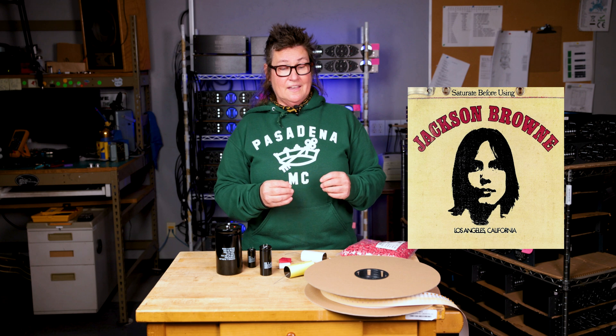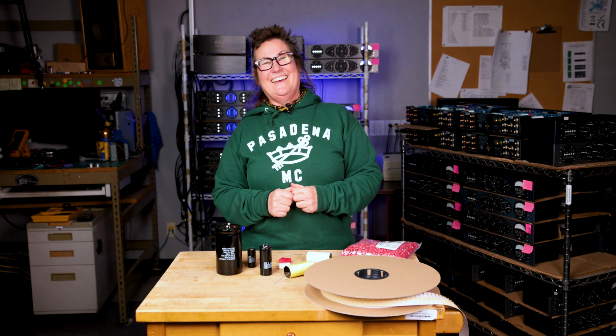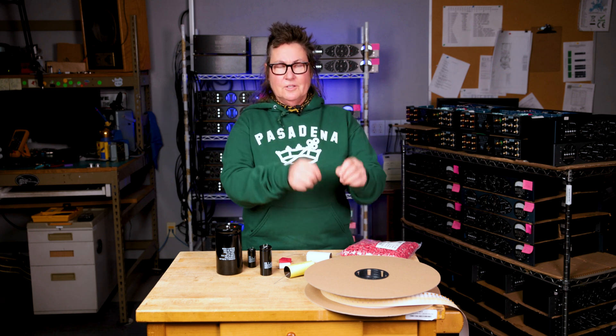We spent the whole day listening to master tape at Jackson Brown's studio and changing out the two output capacitors in the vacuum tube D-to-A converter we were using at that time. We would play the same song off the tape, listen to that capacitor, make notes, and then solder in another set of capacitors and compare them in a quick A-B test.